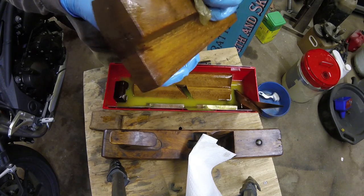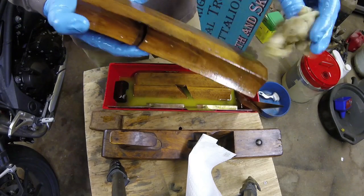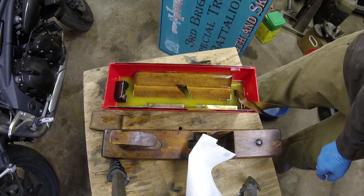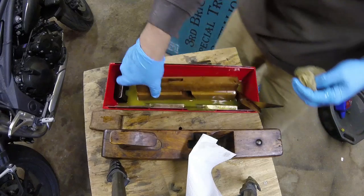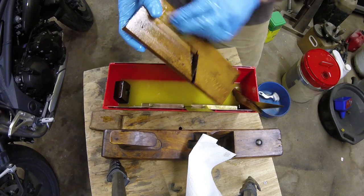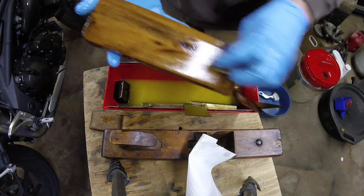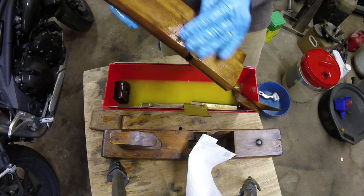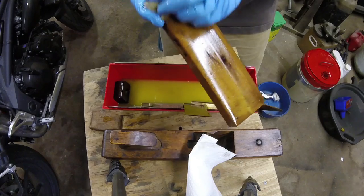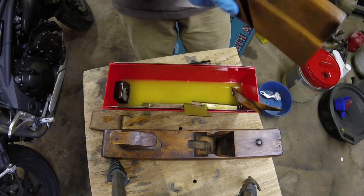I'm wiping off the excess on the inside of the mouth. Since the garage is only heated when I'm in it with a kerosene salamander, these are going to take a while to dry. I'm probably not going to take them into the house to dry - there's no urgency. I'm just going to wipe them down as much as I can, get as much surface oil off as possible, let the rest soak in, and come back to wipe off the rest. As far as I know, I believe I'm going to be done with the process on these planes after this. That was two wipe-on applications that just wasn't doing it for me, so then I decided to soak them.